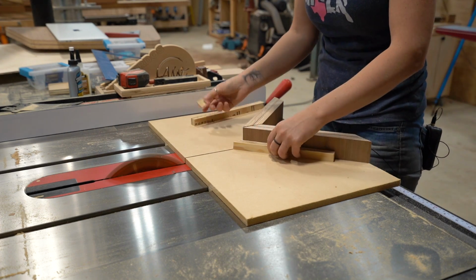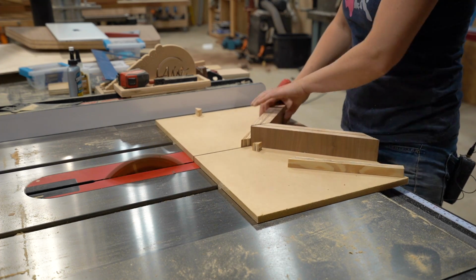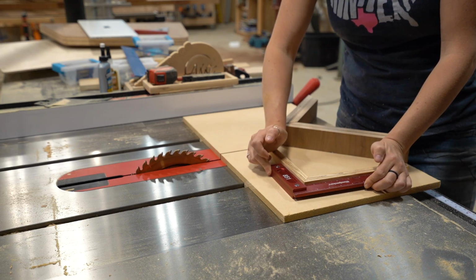You just need to make sure when you're cutting 2 pairing miters that you use one fence to make one of the miters and then the other fence to make its pair. This way, regardless of the slight degree it's out from 45 from the blade, it'll still match up to 90 if this outside face is at a 90.